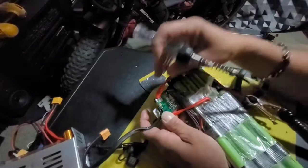If it were me, because I know what I'm doing, I would just bypass this BMS until I got a new one. All you'd have to do is move this ground to where the ground is on your connector and you'd have your 48 volts back and be up and running. I'd run my scooter or bike like that until my new BMS came. But this doesn't belong to me, so I'm going to make sure it's done the right way with a BMS in it, because as I told you in another video, these batteries will burn your house down if you don't know what you're doing.